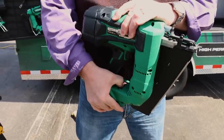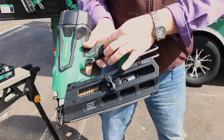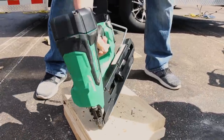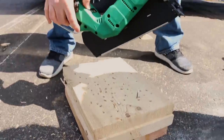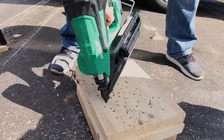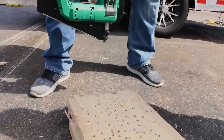To operate: press and hold this button in the middle, the light comes on and you're ready to fire. The safety switch on the side comes down, then the trigger lock, and you're ready to go. For bump fire, push this blue button — it should be blinking — pull the trigger and go. Speed and consistency, consistently driving nails into the wood. These will also shoot into some of the hardest lumbers — the LVLs of the world — no worries whatsoever.